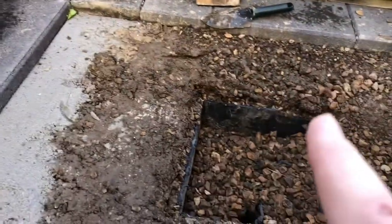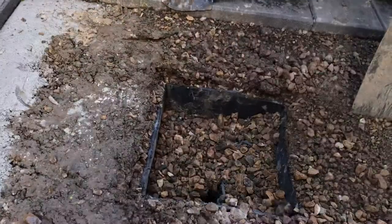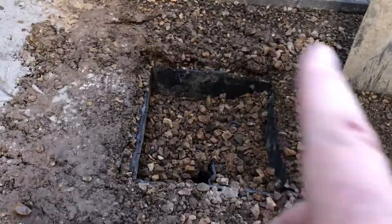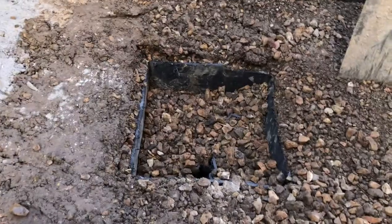As I said, you don't put your paving sand over the top because that'll just wash through the stones, your pavers will sink and it'll block up with sand. We're actually going to lay these pavers directly onto the stone so that will always be there as a drain.